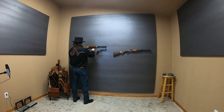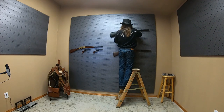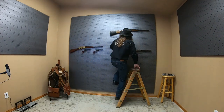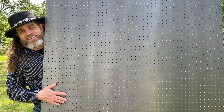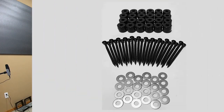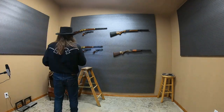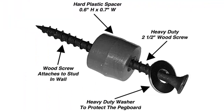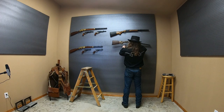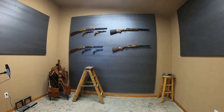I started with a base of half-inch OSB. The four-foot by eight-foot sections of OSB are mounted on top of the sheetrock to the studs on the wall. Then my painted 3/16-inch pegboard — which you saw me paint metallic silver in a previous episode — are mounted to the OSB. I use pegboard mounting kits from Amazon to mount the board to the OSB. Because the OSB is mounted to the studs, I didn't need to worry about hitting a wall stud with the pegboard screws, which let me dictate where they were placed. I spaced the pegboard mounts every 16 inches around the outside and down the center of the pegboard — they worked out fantastic.